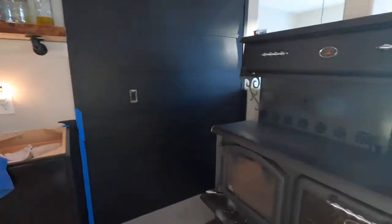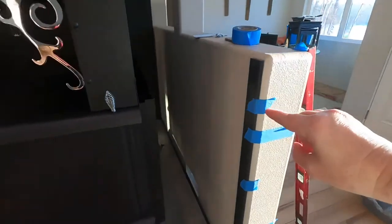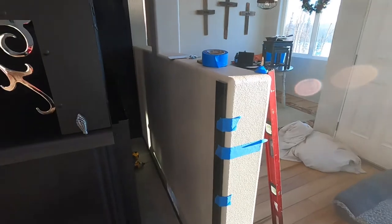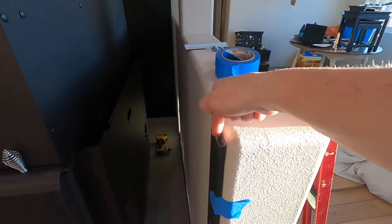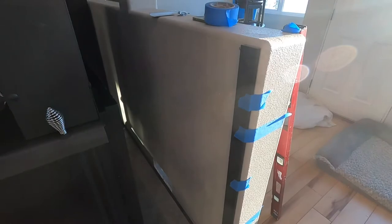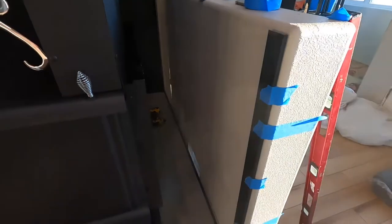So right now, Aaron is working on the pony wall. And what we actually have to do different on the installation here is the panels are sliding down these J channels into the bottom. And then right now Aaron is notching the floor register vent that goes there. Then we slide them in and we'll have the finish trim and we will show you the end product.